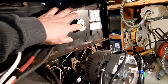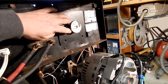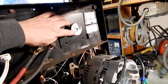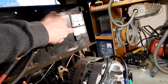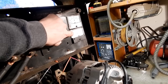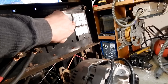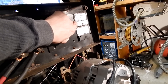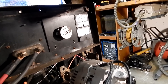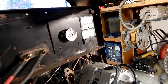This is a big, heavy potentiometer — like a 200-watt potentiometer. I'll show you the back of that. The meters are voltage meters: one is for battery voltage, charging voltage for the 12-volt system, and the other tells me what the welding voltage is. I have a shunt and an amp meter, and I do intend to install an amp meter to replace that voltage meter so I can get some idea of how many amps this thing is producing.